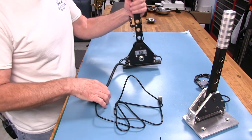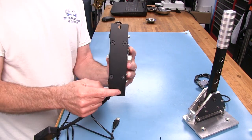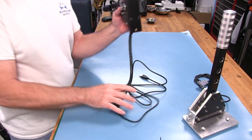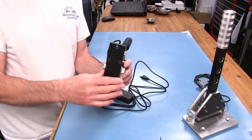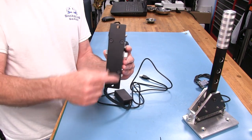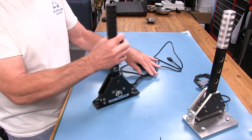What we'll do now is go ahead and get this mounted. We have M8 holes here and here. I've already got some profiles mounted on my main shifting 4080 profile on the P1X that's over with my rig, and we'll bolt it to that with M8 bolts and T-nuts in the channels. When we come back, we'll see how that went.